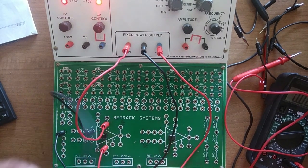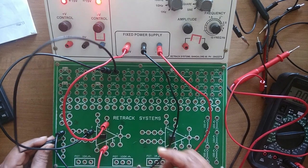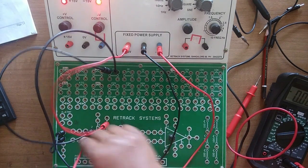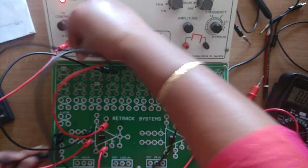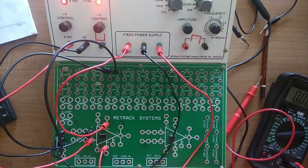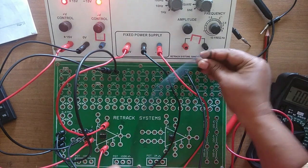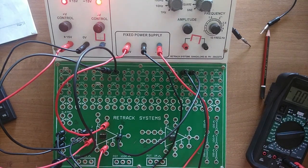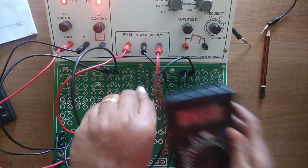Pin number 2 connects to the 1kΩ resistor, and the other end of the 1kΩ resistor connects to ground since we are doing non-inverting. Pin number 3 is connected to the positive input. The ground terminal connects to the ground point. Then pin number 2 connects to 10kΩ, and the other end of 10kΩ connects to pin number 6. Finally, connect the multimeter negative to ground and positive to pin number 6. Let us take the readings quickly since you have understood the concept.